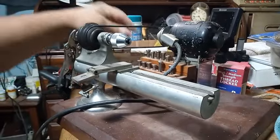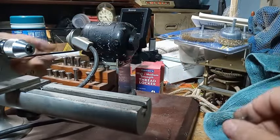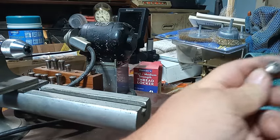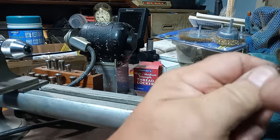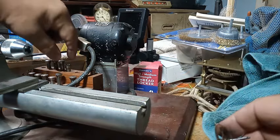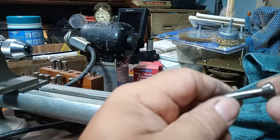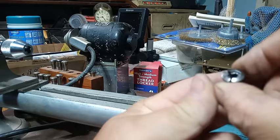And like I said, the collets, it's a watchmaker's lathe. I've got collets in here that have bigger holes. This collet right here has got the biggest hole. But there's some parts that you can't tighten up enough. I tried drilling this one, and I got a hole drilled, but as you can see, the side of the collet kind of bent away.